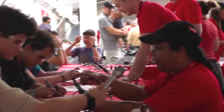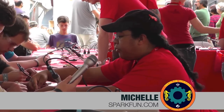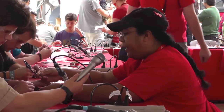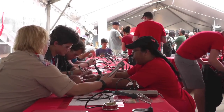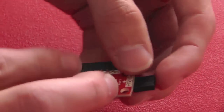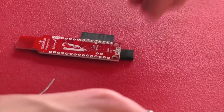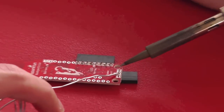Now we're gonna move this board aside and go on to the Arduino board. You'll notice on the back of those we actually highlighted some of those in white — those are the pins we're gonna use today. We're gonna start with this right angle female header and stick that in on the other side of the board. Flip that over and you can go ahead and solder those in. Once you're done with those you can go ahead and put the game port on the end as well.